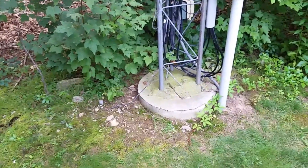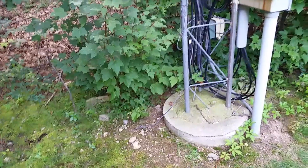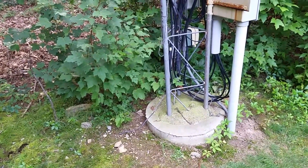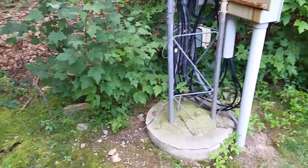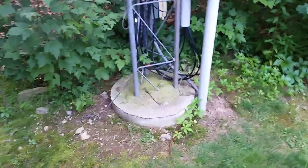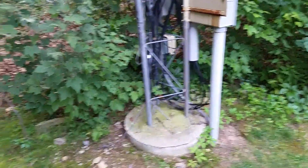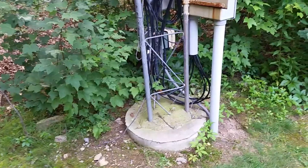The issue I had with the tower in New Hampshire, if I saw it correctly, is that he dug a hole and put concrete in it, then put the tower in — or put the tower in and then poured concrete. Up here in New England and for a fair amount of the US, we have winters severe enough to cause the ground to freeze and we get frost heaves. You want to make sure that the side of your base is as smooth as possible — which is what a concrete form tube does — so the ground slides on the side instead of trying to lift or distort it.